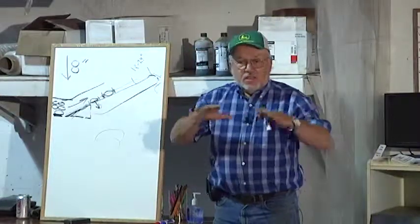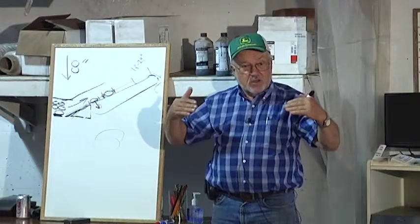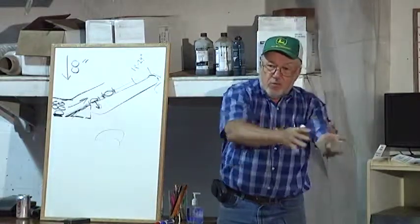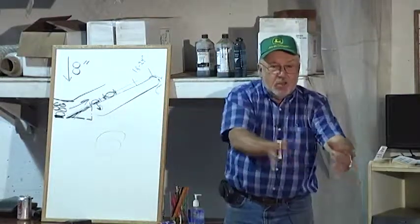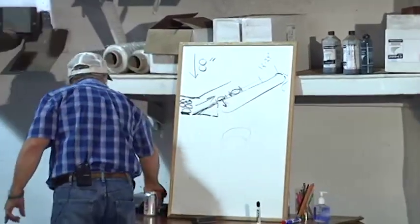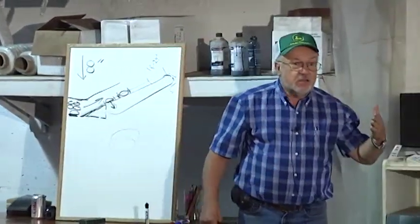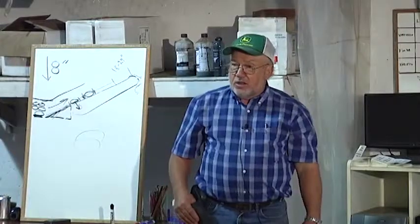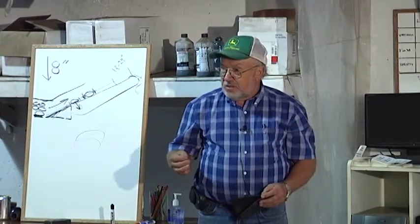On the side caster, the rear cross — some are pretty much level, some are sloped to the rear. If sloped to the rear, the idea is to get potatoes to move further back so they're not all on the front edge and get sucked back under and dropped to the ground. You want them to get off the primary and away from that transition point onto the rear cross chain. The challenge on the rear cross is that the backside wall is steel, and potatoes — particularly the big ones with more inertia — will go back and hit that back wall, causing damage.